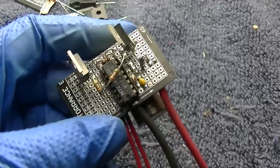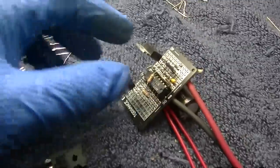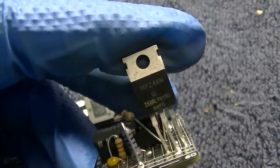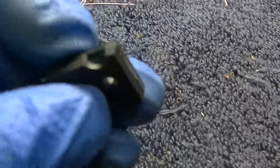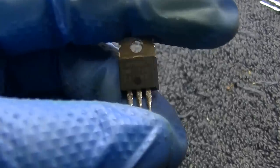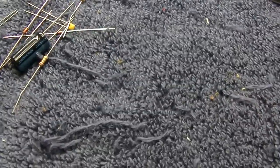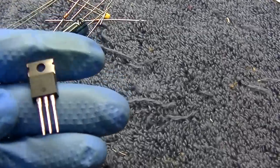This is the completed prototype solid state vibrator - my first run, which my second won't be much better because I'm going to copy this. These are the counterfeit FETs - IRF Z46N - you could get these off eBay real cheap. These right here are 200-270 amp units. I'm going to use these non-counterfeit ones for the car radio I'm going to restore - they're IRF 3205, and I think these are 90 amp. These have really come down in price.